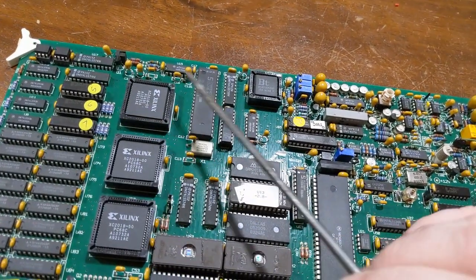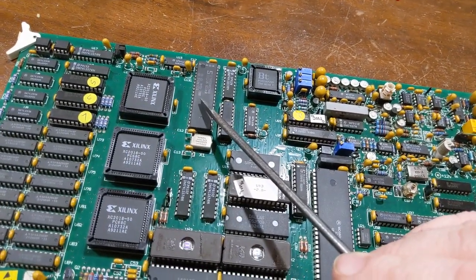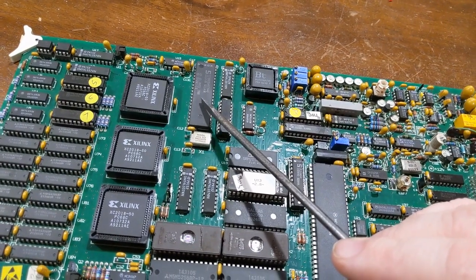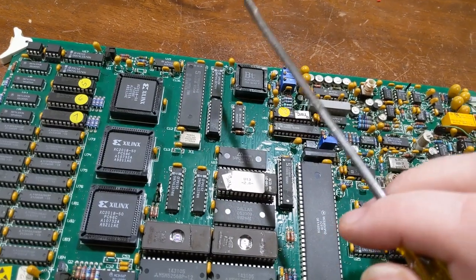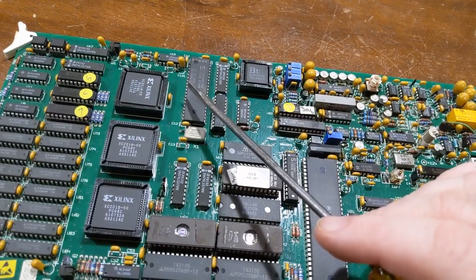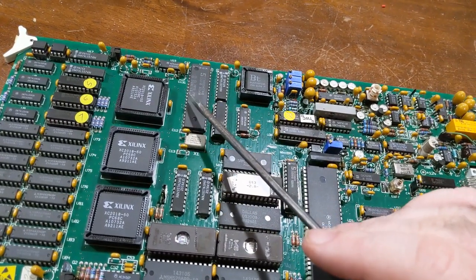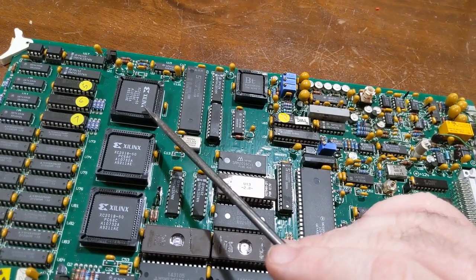So the frame buffer control processor, an 8051, has a UART. Well, this UART is programmable. You can program it to be asynchronous, like RS-232, but you can also program it to be synchronous, so it has a clock and a data line. Well, that clock and data line is what communicates with this FPGA.